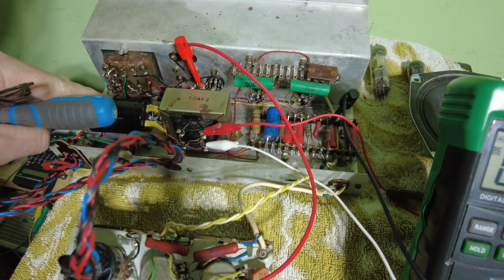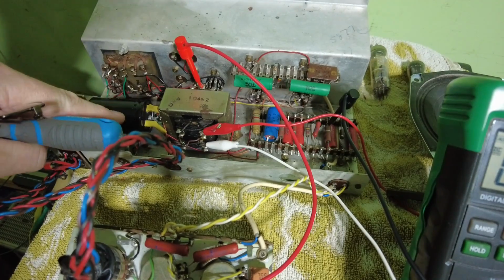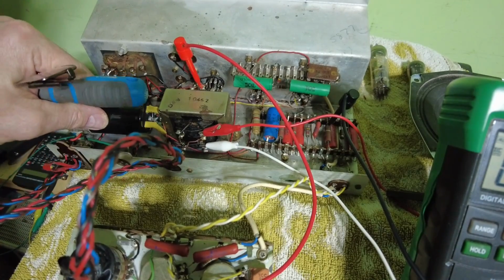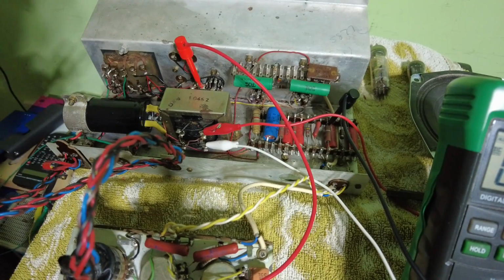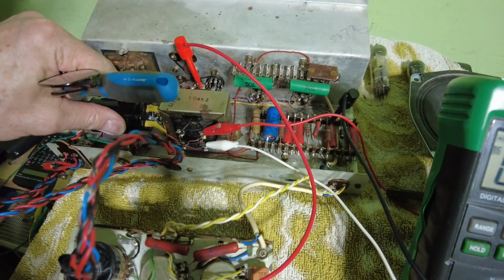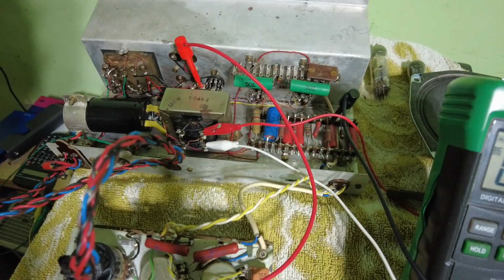and I'm a bit peeved that the writing's on the underside, but unfortunately that would mean turning the live feeds down towards the chassis, and although I've insulated them, I don't really want to do that. So really the ground terminal needs to be closest to the chassis, but we've got that in, and that's not really cured our fault.